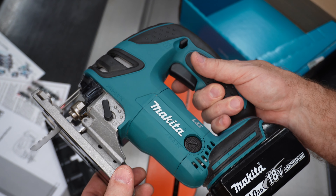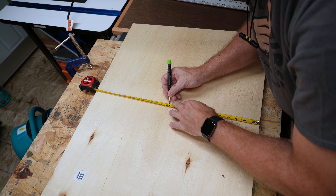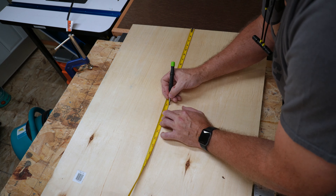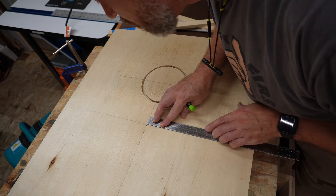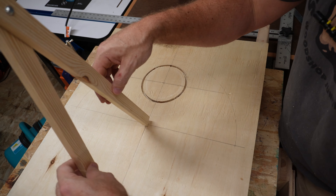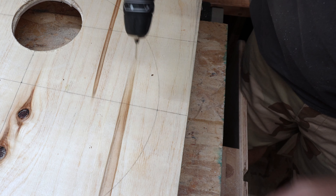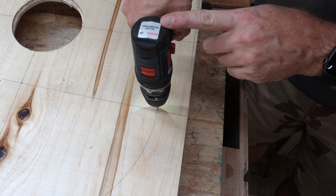I begin by measuring out the center point. This is for a cornhole board where the target hole rotates on a motor that's mounted underneath. So I'm actually measuring the center for two holes — the target hole and the 20-inch circle around the target hole. I use a center punch to make an indent where the center lines meet. I'm using a super sophisticated compass to mark out the circumference. Normally you would drill a hole slightly larger than the jigsaw blade to get started, but I only want this cut to be just the kerf of the blade. So you could use an oscillating tool with a fine tip, or a Dremel tool, or a drill with a skinny drill bit and make several holes, which is what I'm doing here.